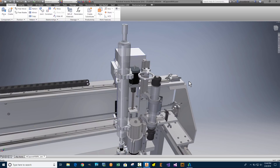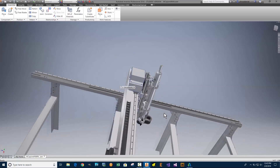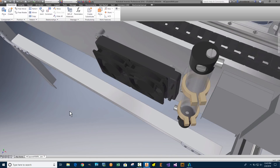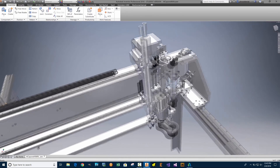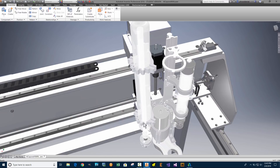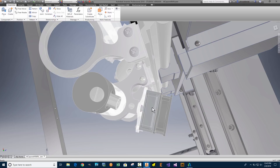However, we elected to take the water reservoir for the 40-watt laser away from the laser and put it on the back because there's really no room on the head. We also decided to put a larger radiator with two fans for the laser so it can work more efficiently for a longer period of time. In this video, I want to show the process of cutting the mounts for the laser, for the water reservoir, and for the radiator on the back.